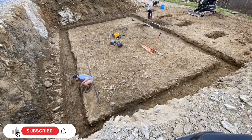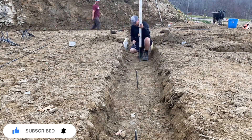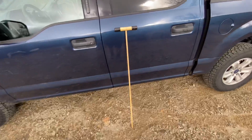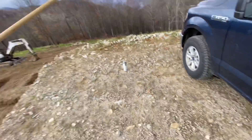So today we're going to be putting steel in the footings, we're going to be adding grade pegs for the concrete, and we're also going to be adding j-bars to reinforce the wall out of the footings, and a bunch of other stuff. First on my list for today, I'm going to take my soil probe.